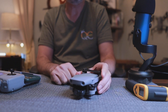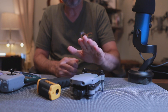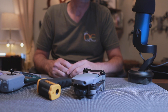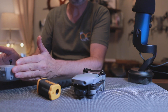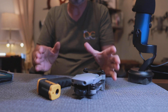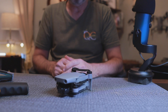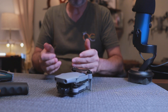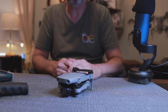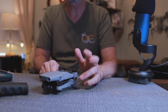That is how you do all of your calibrations — IMU calibration, horizontal calibration, gyro calibration, and gimbal calibration. Everything is fully calibrated. Do this on a flat, level surface away from metal objects, magnets such as speakers, and your other electronics. I like to keep the quad on my dining room table where there's no metal or interference. Hopefully this was helpful — when to do them, how to do them, and how hot it gets. If you're new to my channel, hit that subscribe button, and as always hit that thumbs up on your way out. Peace and love.